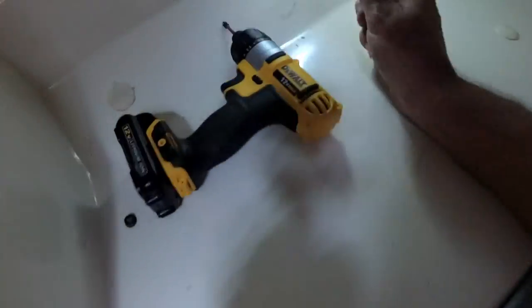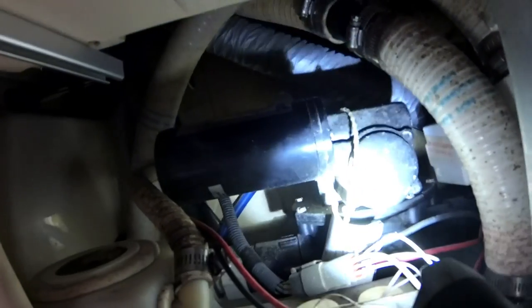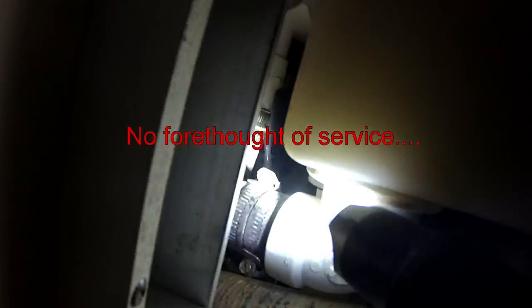Here's the head system. There's the vacuum pump, the holding tank, the vacuum accumulator, the pressure switch. And up in here you can see a white pump — that's the macerator pump.